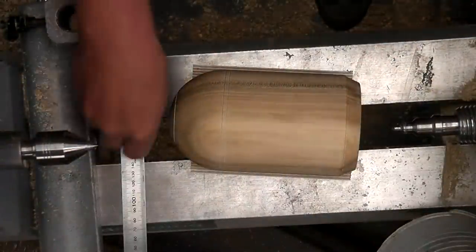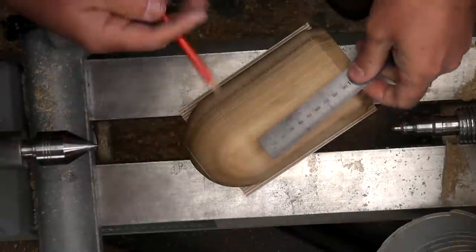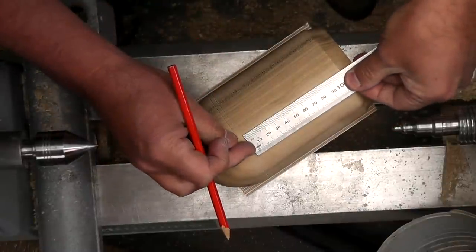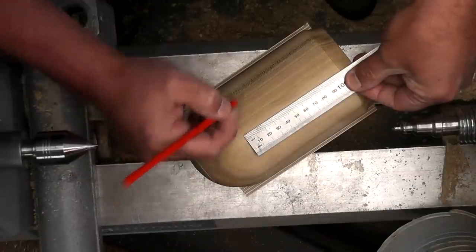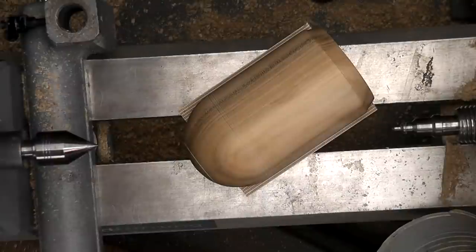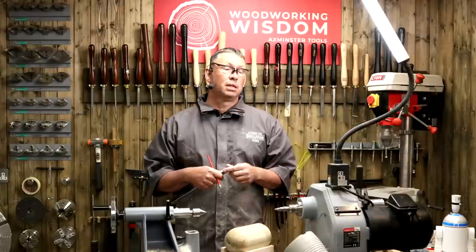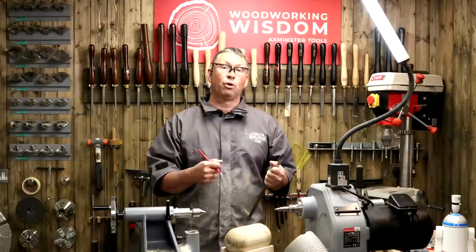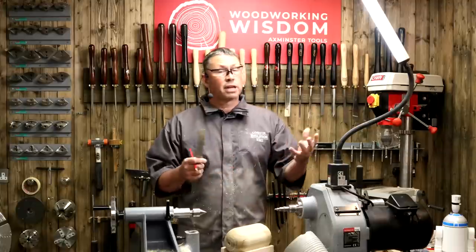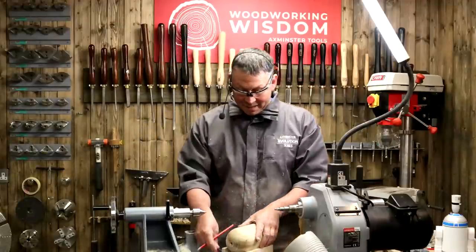Yes, Ben, another question. A question from Malcolm. He says he sprays on the sealer with a couple of light coats and it's instantly dry. Is there an advantage of painting it on with a brush and then wiping off the excess? Not really. It's my preference. I prefer to do it that way. I just feel I'm at more control in the thinning stages, that's all. And like I said, if it's a really exotic or dense material, I want to get really lathered on and let it absorb its way in. That's the only reason. I've always done it that way, so I've stayed the same.